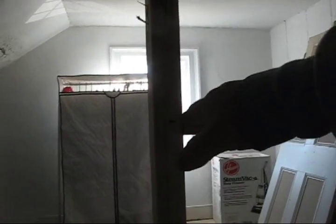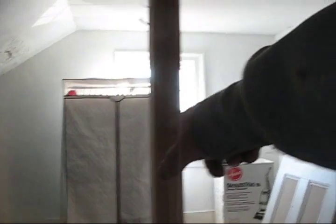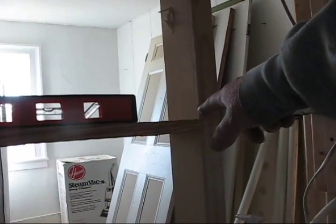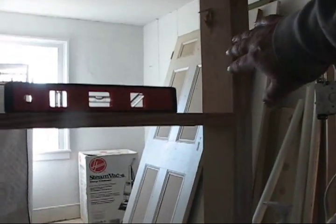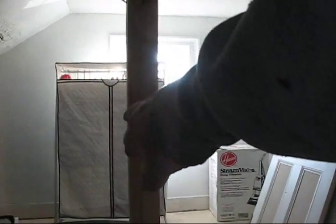I don't want you to tell anybody you saw me using this level — it would ruin my reputation. This piece of wood here is exactly the width of the cabinet. I'm going to put it between these two boards, put another one up along inside of here, and saw this out with a handsaw. I'm going to take this piece of wood that I saw out and put it inside of here. It should be exactly enough to move the cabinet over one and a half inches, which is the width of this, and put it right where I want it to be.